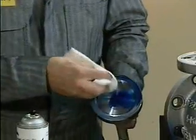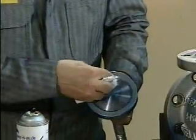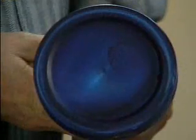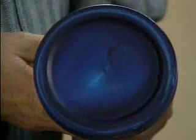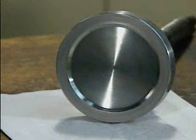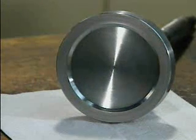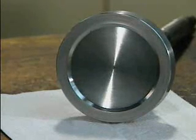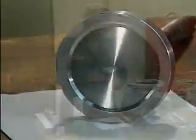When he's finished inspecting the valve disc and seat, the mechanic wipes them clean of the bluing. Imperfections detected in the disc or seat during spotting in will require repairs or replacement. Many valves are equipped with replaceable parts, which make it more economical to replace discs and seats with severe imperfections than to repair them. Check with the supervisor on the policy at your facility.